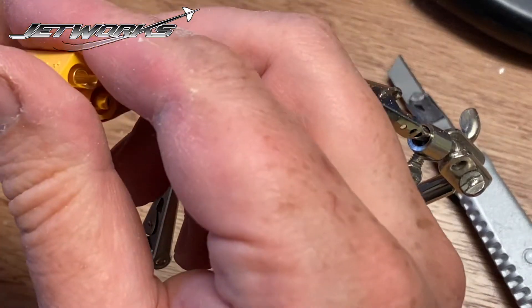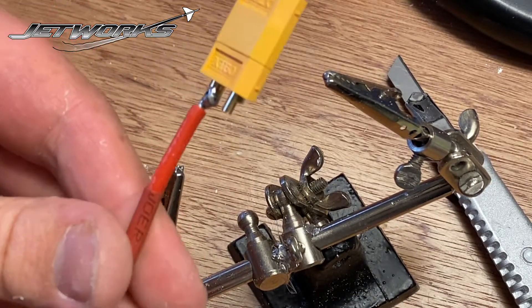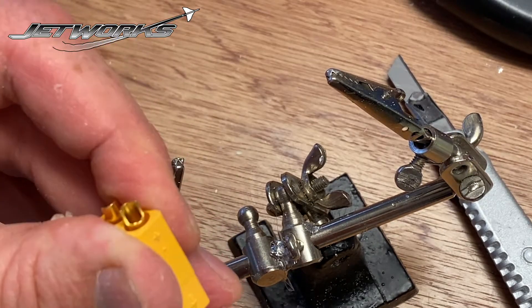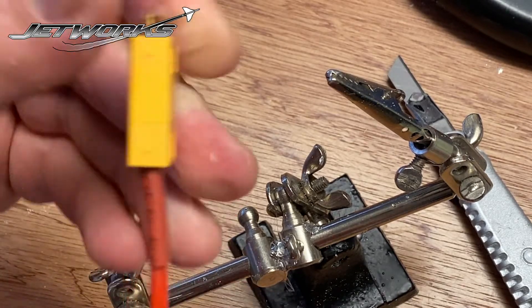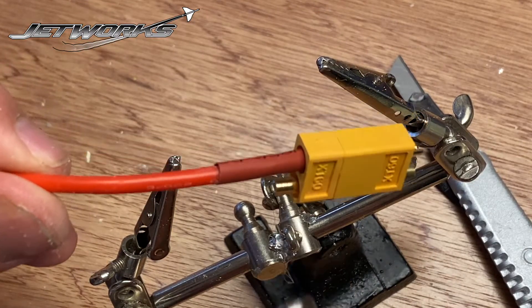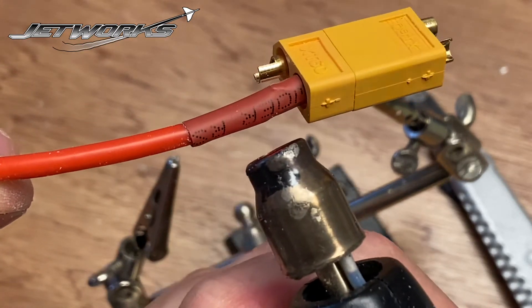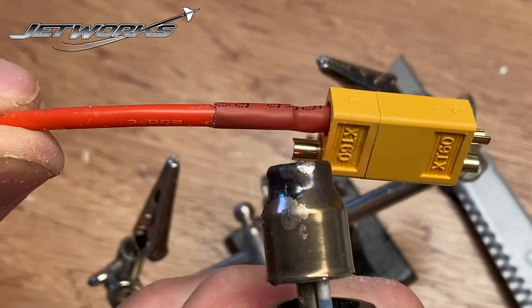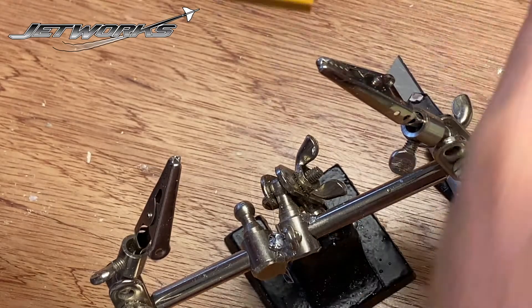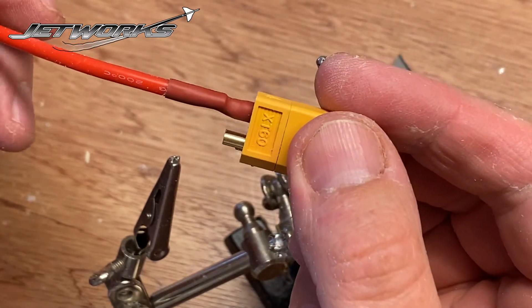So I'm not going to do the other one until this one is safe. I'm going to slide the heat shrink down and over the soldering. There we go — you can see that's now shielded it, and I'm now going to use the heat gun. And that is now just going to shrink that around there, so we've got no metal contact showing, apart from this side of course, which I can deal with.